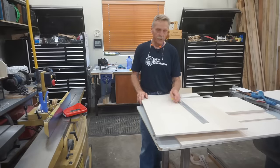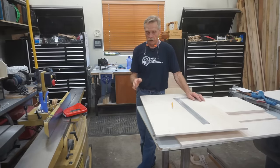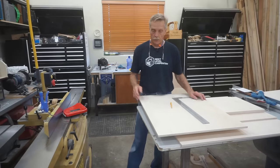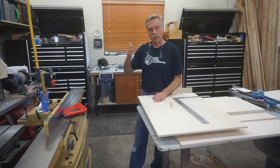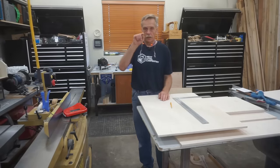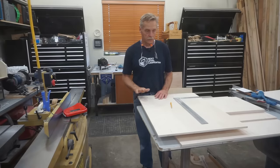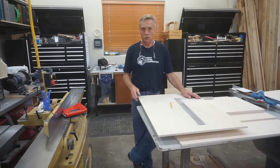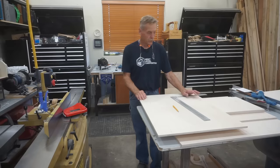And I guess I've gotten a reputation for digging in the weeds and going into detail and not worrying about video length. So I'll pile on a little bit here and say that I've got carbide knives. It's a helical head in this joiner, and if you have high-speed steel knives in a joiner and you plane Russian birch on its edge, and my old joiner, or this one before I had the carbide knives, there's something of an abrasive quality about that glue. It can actually put little ribs in your joiner knives. It doesn't do it with carbide, but if you're doing this on a joiner with high-speed steel knives, you might want to crowd one edge or the other so you don't put little grooves right in the middle of the blade. And I'm not sure if that's true for everybody's blades, but a word of caution. I think that's about that.